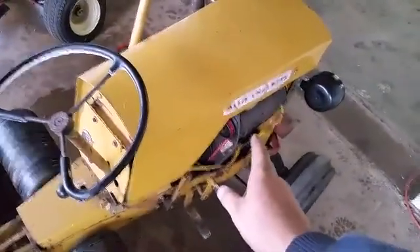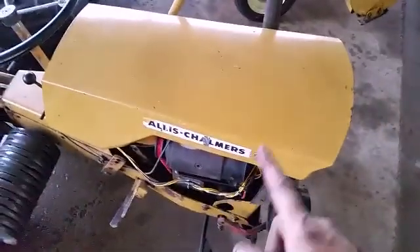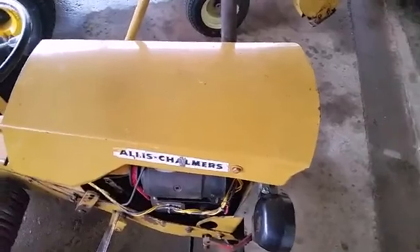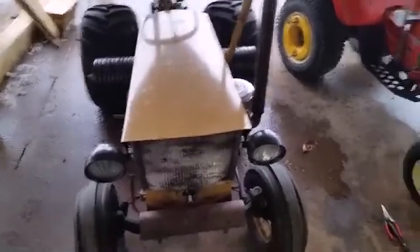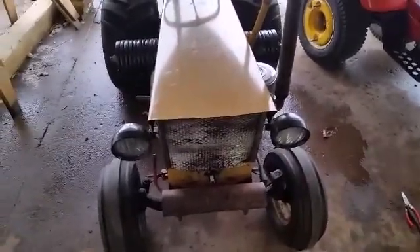Sounds pretty good to me. The original RPM of this engine was 3400, so I'm going 400 RPMs higher than originally intended, but I'm very careful to make sure it's not running lean and won't backfire — it's always going to be under a decent load if it gets revved up normally. So I've got 25, well 25 or 26 degrees before top dead center on the ignition, with the coil moving about 5 degrees on the engine.